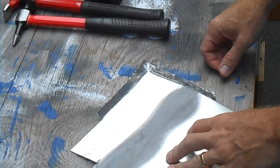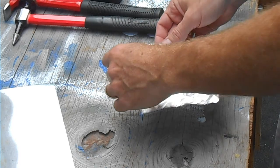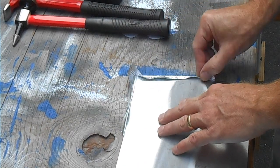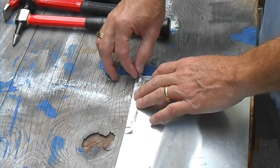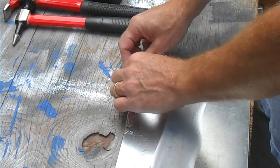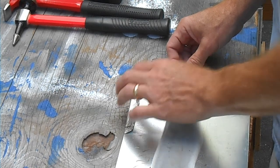Here's a little demonstration I set up to help myself understand what's going on with this door skin. I have a piece of aluminum foil that I have creased on two sides to make a corner, and then I just have a flat piece of sheet metal here to hold everything in place. This will represent the door shell, and this will represent the door skin. When I put that skin around the shell and fold over the flange on the side, then fold over the flange on the bottom, there was too much material at the corner and I wound up with this big bump of material left over. It's not as easy to work with as aluminum foil - it will also fatigue the steel to the point that it might just crack. It's not as malleable as this really thin foil.